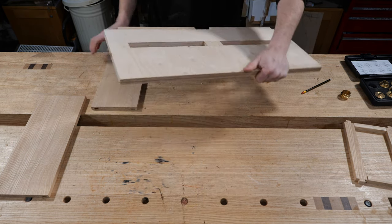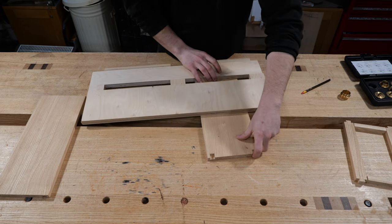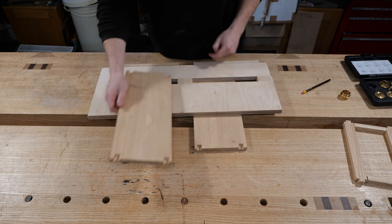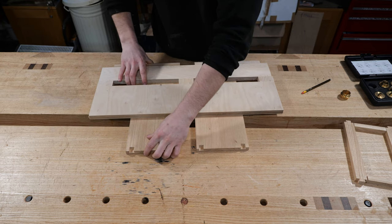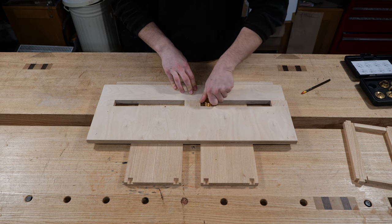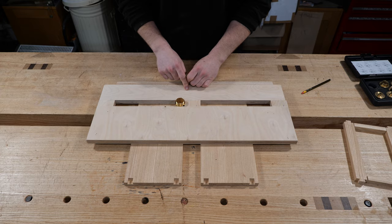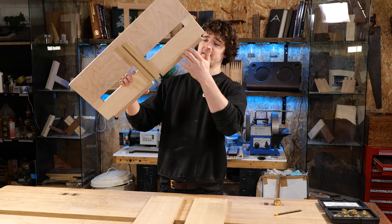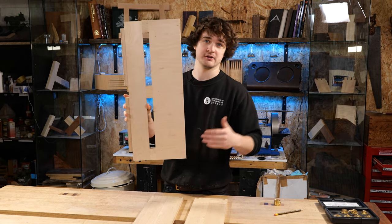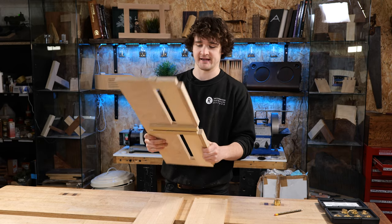Effectively, the front of the cabinet lines up with the stop so the router cuts from back to front and is stopped before it blasts through the front edge. The two pieces get clamped down individually — you don't cut them simultaneously. The stops on the bottom are super glued in place, the spacers that create the slots for the guide bush have been dominoed in place, but they could also be biscuited or butt jointed. Plans for this jig are included in the plans for the cabinet.